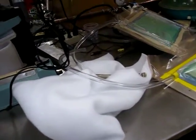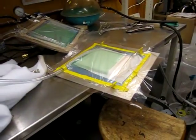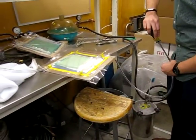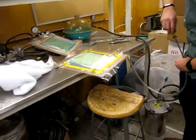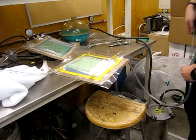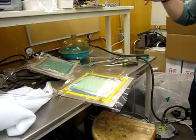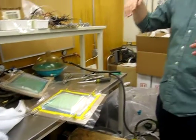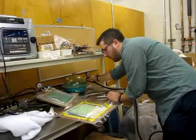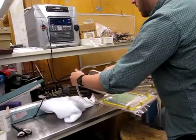Your standard calls for your bag to hold 17 inches of mercury with no more than a two-inch drop in five minutes. What we're going to do is pull even more vacuum — we're going to have 30 inches of mercury. This is just going to create a larger pressure differential, so it's going to get a larger slope. What that's going to allow you to do is pull your resin through fast. We only have an hour to play with everything, which is why we need the biggest pressure differential we can get.